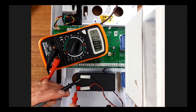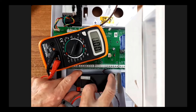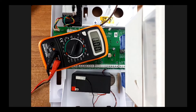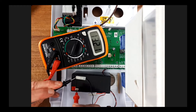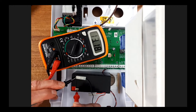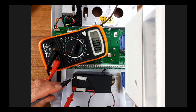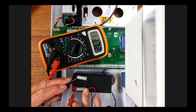The battery is being charged by the control panel and we're reading 13.73 volts. Now if I remove one terminal, the battery is disconnected, and it's now reading 13.21 volts - the voltage has gone down because it's no longer being supported or charged by the alarm control panel. So if you test the battery with the power on, it would look like a great battery, but that's misleading. With it reconnected and charging, we're back to 13.72.